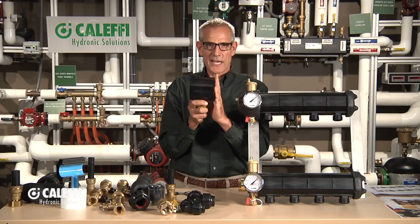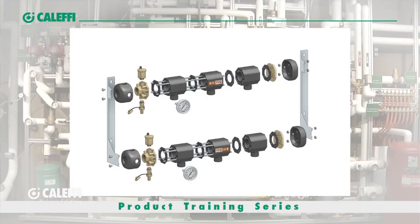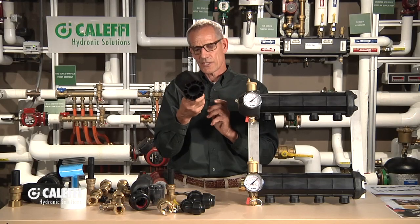Here's an actual segment of it. These go together in sections with a gasket in between them, and that's how we build them for whatever you tell us you need — whether it's a six-port or four-port. We just assemble these with a gasket between them, and then there are stainless steel rods that go through that we torque together. That's how the system is built.